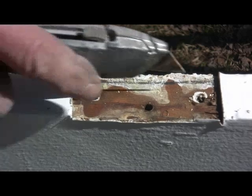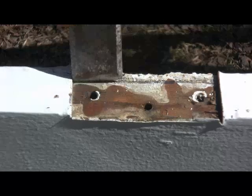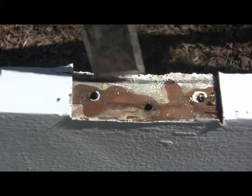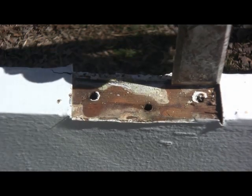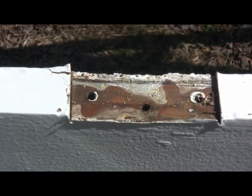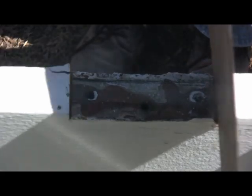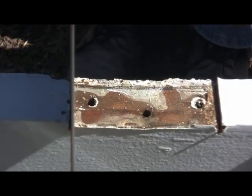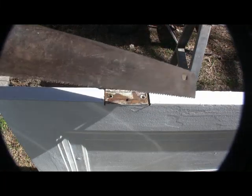You can do it one of two ways: with a utility knife or with a chisel. You don't want to hit it too hard because this will split and then you've got a big crack that's hard to fix, especially with old lumber — the stuff is so brittle. Now we come in and get the final side. These old hand saws still come in handy every once in a while — that's why I keep mine around.